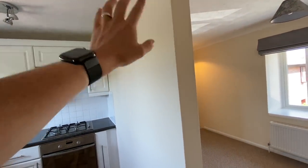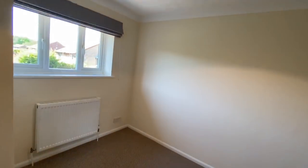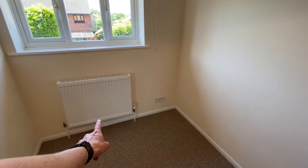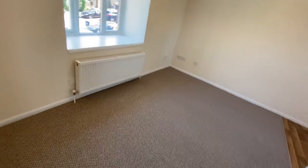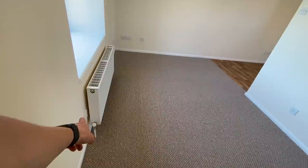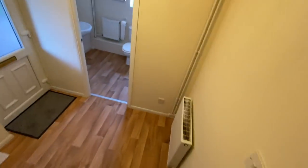This socket, I don't know what it's for. That spur, I don't know what it's for, but it looks like they've done a bit of a renovation in here. Turn all the lights on, make sure they're all working okay. Two-way switching's working, bedroom light's working. So that spur would have been for a heater as well. So they would have had one in here. I've got to check up in the loft, see what's going on there. That is blanked off, but there might have been a heater there before as well. So have to check that out. Wow, funny little one.